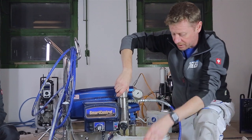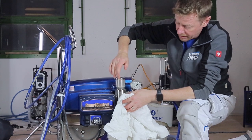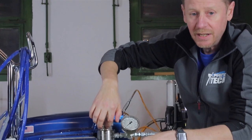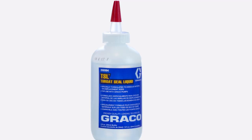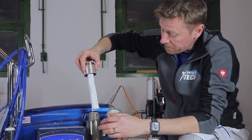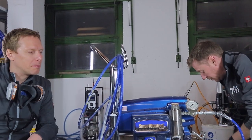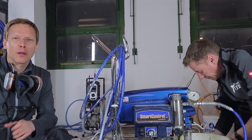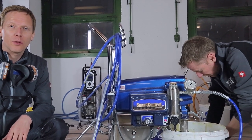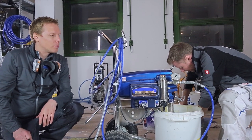So we'll take out the manifold filter first. The chances are we're going to get a little bit of random residue. A little trick here is to add a little bit of TSL, or any form of lubricant, depending on what your machine is. Especially if you have an older sprayer - this one has a thread which is already a bit bigger, but there are older sprayers where you have a thinner thread, and it gets more complicated if it's not lubricated or you have some old paint hanging there. That helps a lot if you put a bit of oil on it.